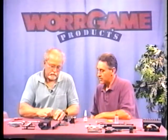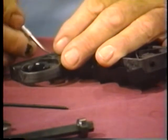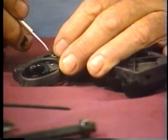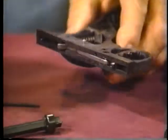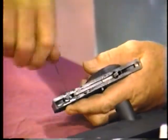We're going to pop the sear clip off of the safety. It's on there pretty good, so. Yeah, this is one of the first unauthorized modifications that most people make to the gun. They remove that safety and leave it off. The safety is a very important thing. Take the clip off. Make sure there's a little ball and spring right here. Make sure you take the little spring out, and then the ball should follow. Sometimes this one's stuck in there with some Vaseline. There's your safety. Now we're going to have to loosen two little Allens. Take the trigger shoe off.